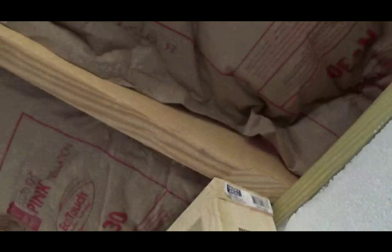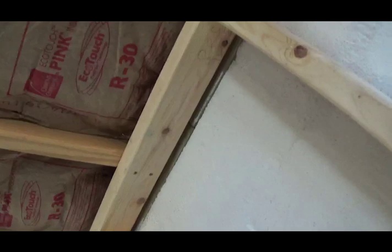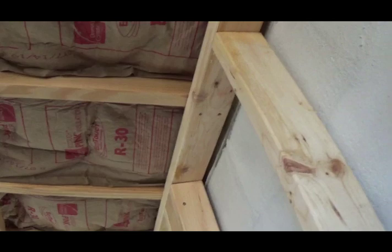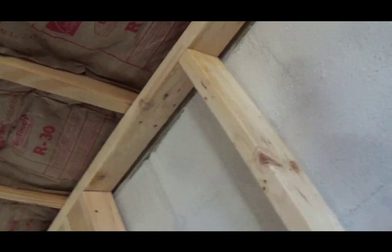So I get a good screw point, so I can screw those. In order for these rafters to go down, that's kind of kicking out the bottom. This just keeps the bottom from kicking out. They've got little metal brackets, but those are just little metal brackets. Now it's tied into something more substantial. In order for it to scoot out, it has to move this wall through the concrete, which would be braced by the stones and dirt on the outside.